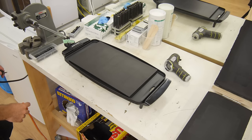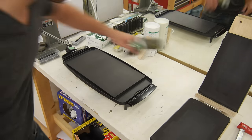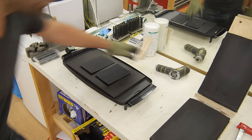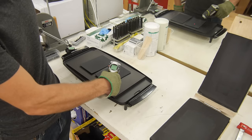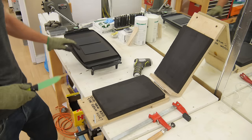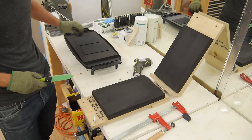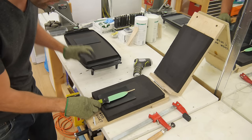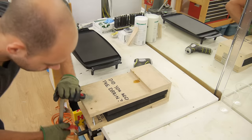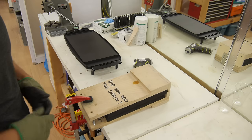Now we're going to turn on the griddle and preheat it to 340 degrees Fahrenheit — I'm getting 347, which is perfect. We're going to leave the Kydex on it until it's completely flat and until it reads 290 degrees Fahrenheit on the top surface. The Kydex sheets are now reading right around 290 across their whole shape, so you can see how very flexible they are. We're just going to grab it, put it in the press with the knife on top right in the middle, close the press up, and leave it for about 10 or 15 minutes so that it completely cools off before you take it out.